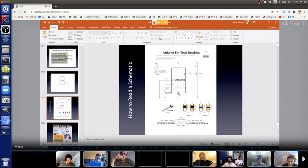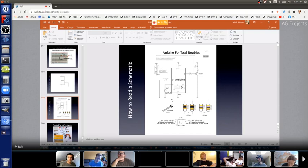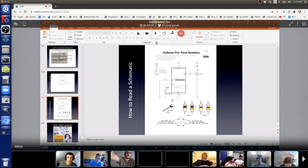And then I also have this resistor. But there's a little bit of information here about this resistor. If you're in Europe, you need this resistor. If you're not in Europe, you leave this resistor out. So EU is Europe, NA is North America. So NA, no resistor. EU, use 1K. So that's the way to tell the microcontroller with a controlling program to send out European codes or North American off codes, because they have different sets of makes and models of TVs.